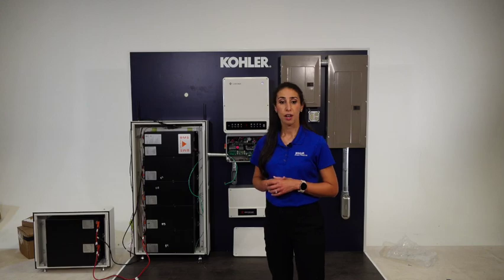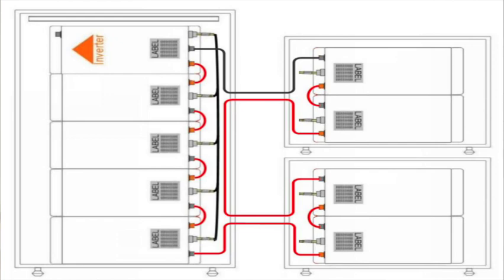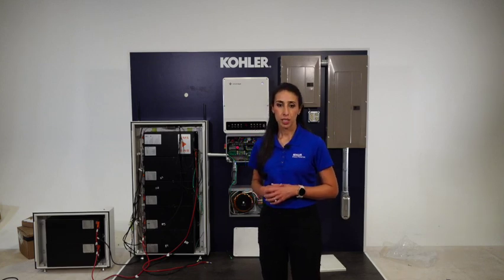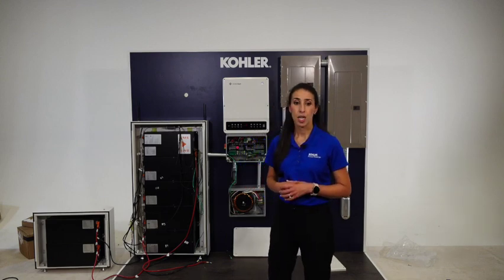Now we will show the connection of the batteries. In this video we will show the installation locating the inverter to the right of the battery enclosure. If you are installing the inverter on the left, the batteries and BMS must be flipped. The COM-IN is on the top and the positive connection is on the bottom. The first step is to identify the harness kit to begin wiring the battery modules. The harness kit includes a set of communication wires and the power cables. Depending on the size of the battery bank the number of wires may vary. For this video we will connect the 15 kilowatt hour system. Begin by connecting the COM-IN cable into the COM-IN on the BMS. With the same communications cable connect to the communications port on the battery beneath the BMS, second from top position labeled D1. Continue to connect the same communications cable until all of the batteries have been connected.